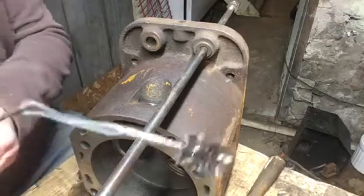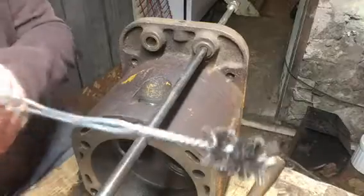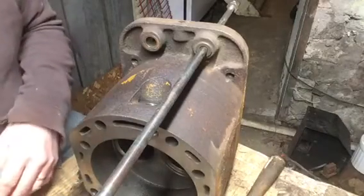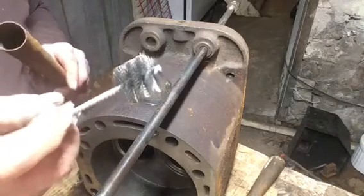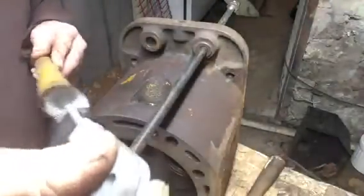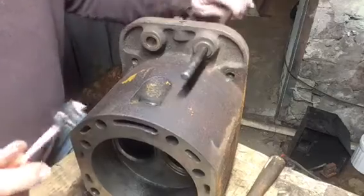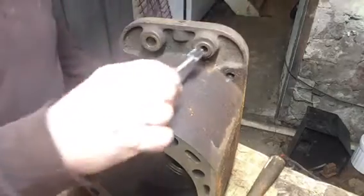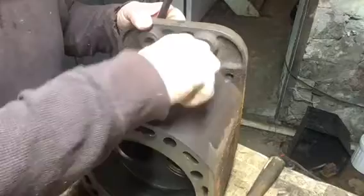For cleaning these head bolts, I broke the plastic handle out, pinched it flat, and just put it on this rod to run it through with a drill. And for the push rod tubes, I have the bigger one. That one I'll probably cut off here and weld a rod to it so I can run it with a drill to go through and clean the inside of these push rod tubes. But that'll come later. And to clean the inside of the guide, I have the smallest little 1/2-inch brush that works just perfect for cleaning the inside of those. It's a good tight fit.